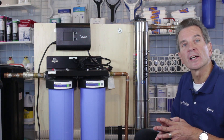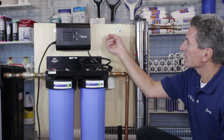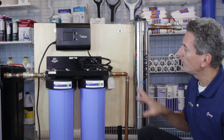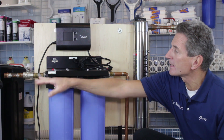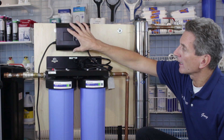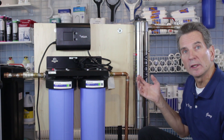If you're not sure about how these ultraviolet disinfection systems work, click the link up here — it'll take you to a YouTube video that explains how an ultraviolet disinfection system kills bacteria in your home or cottage. This system will all be installed on a piece of plywood or solid core wood. It should be configured with the pre-treatment filters here and the water flowing through the ultraviolet light. The electronics should be placed above any of the plumbing, because in humid conditions or summertime these pipes will sweat and drip, and you don't want water dripping on the controller.